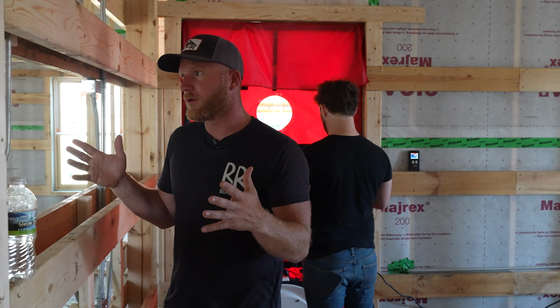For me personally, my goal is sub 1 ACH. Now, the last house we did, that was like 0.4 or something. But you've got to remember, you're talking about air volume exchange, and that last barn door was probably, I don't know, Randy, was it 3 or 4 times the volume? Somewhere in that neighborhood, yeah. So it's going to take a lot more air leakage in order to pass all of that volume through holes. So if that makes sense, the smaller the house, the harder it is to get a low score on the blower door test.